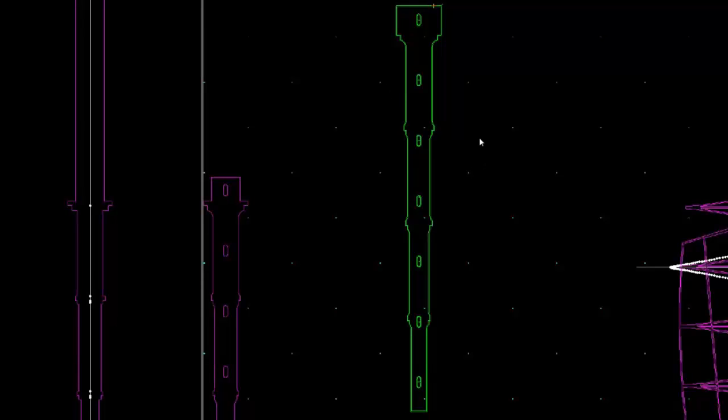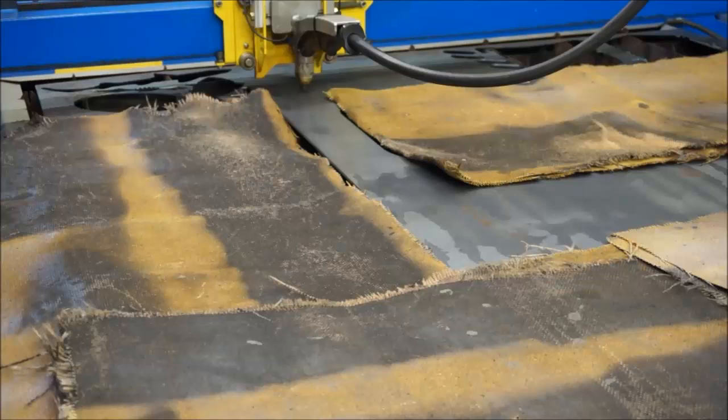We've designed each one of the intermediate ribs to be exactly the same. Up at the top we know it's going to be flanged, but we left this straight on the outside so we can create a cutout that's not going to come back down into our actual stem diameter. It'll be radiused up and then this is where the top plate will flange out with a slight angled weld. We might even do a reverse prep because the rudder we have as a sample actually has a flange where it wears on bearings. We're contemplating what's going to be in here—right now it just leaves the material on the shaft so we can get that diameter. I think we're pretty well set and we're going to start our cut.